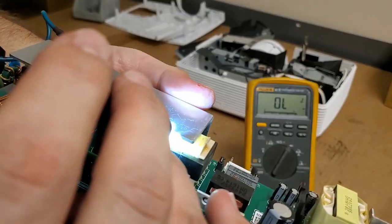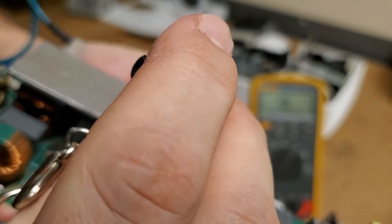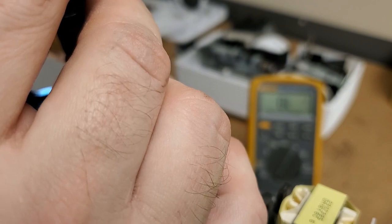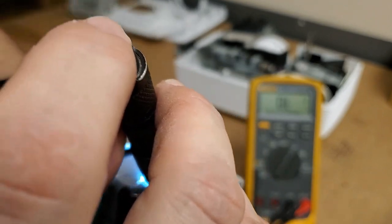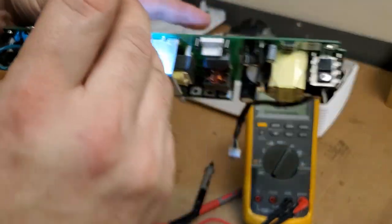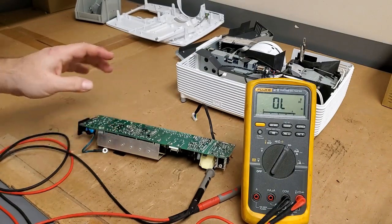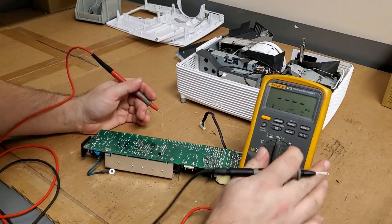Let's see, that says PJA. No, it's not the part number. 8Y maybe. All right, we have an 18N50T. Okay, 18N50T, so that's a 50 amp MOSFET right there. That would make sense. Then we have, what's the other one? 18N50T, they're both 18N50Ts, and one's not measuring the same as the other in circuit, mind you, but they should be a little closer.